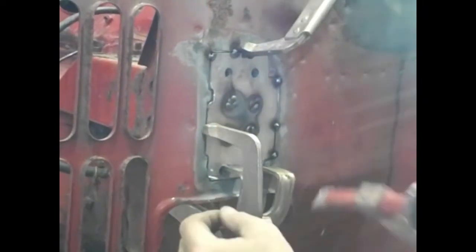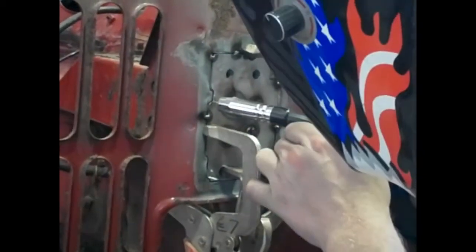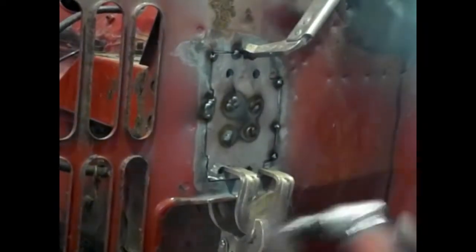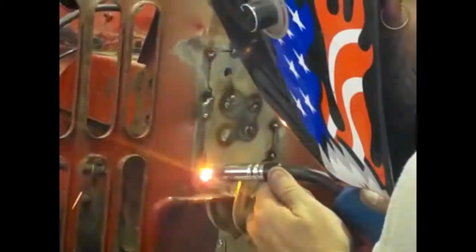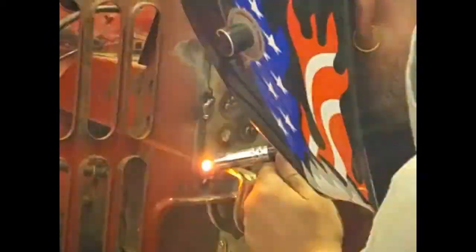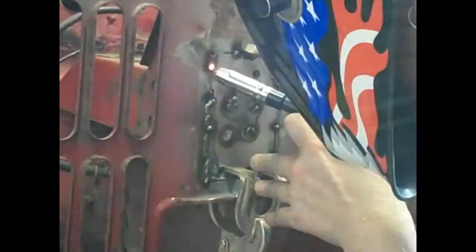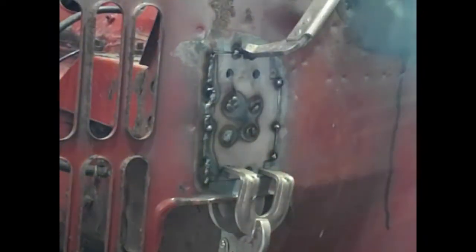All I've done is tacked it around and then tapped it into place. Since this is going to be visible you want to make sure it's as flush as you possibly can before you weld it, otherwise you're going to end up with overlap at the welds. In this instance I'm not too worried about distortion because there's a box section that's going to hold it all in place, so I'm just going through with nice long welds, keeping the heat in there for decent penetration, then tapping it down again to make sure it stays flush.